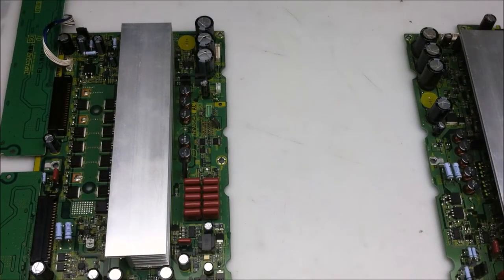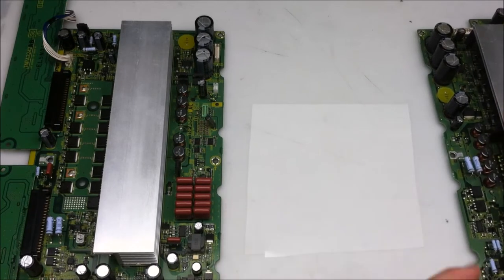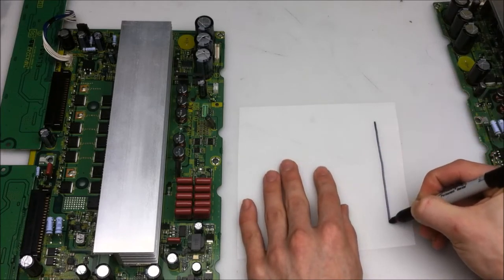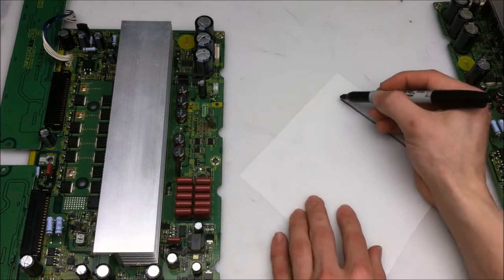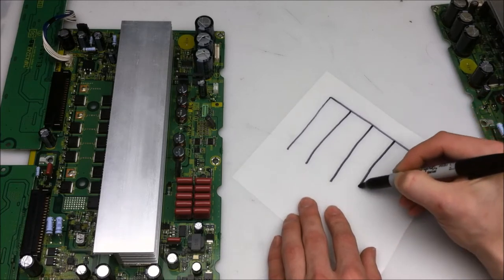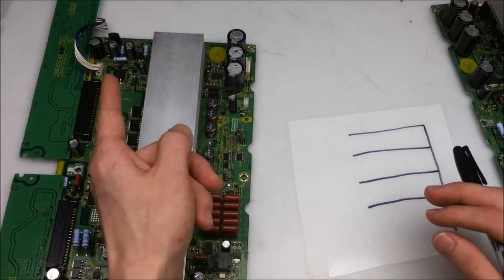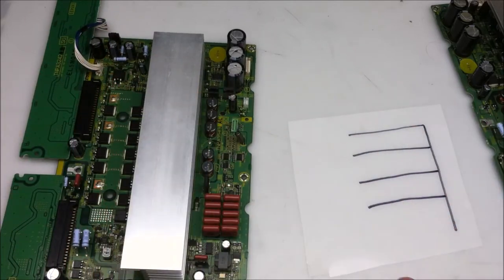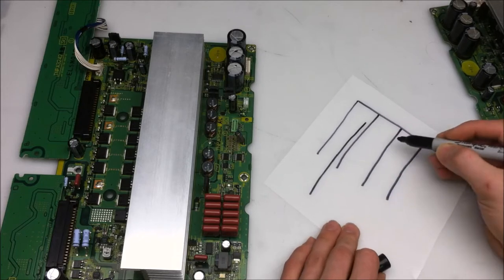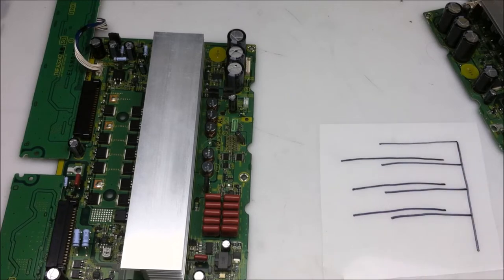Let's do a little illustration of how that actually works. So let's draw the connections from this first, and all these connections, as I said, are tied together. So we're going to draw one big interconnected plane and a set of horizontal lines that go across. So those horizontal connections are like this. Now, this board independently controls the voltage going to those horizontal lines. And so on the other side of the pixel area, there is, for each row, another horizontal conductive pathway.